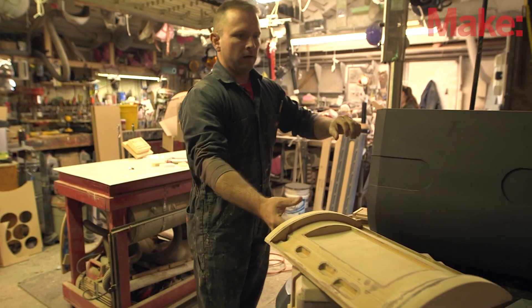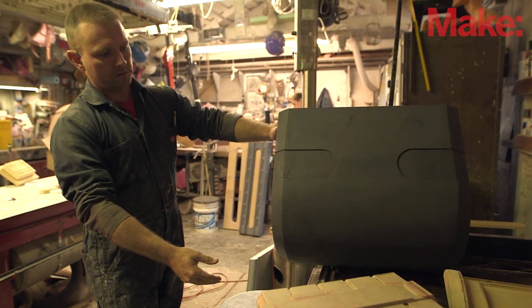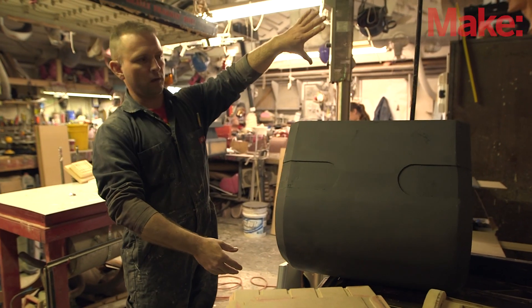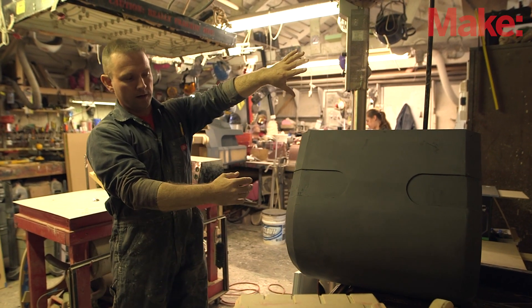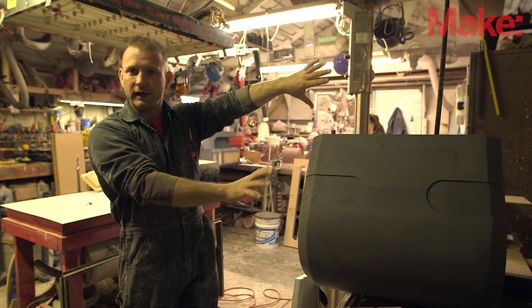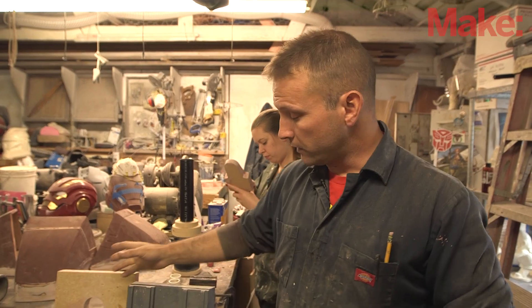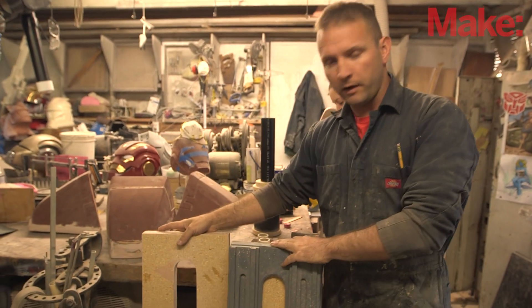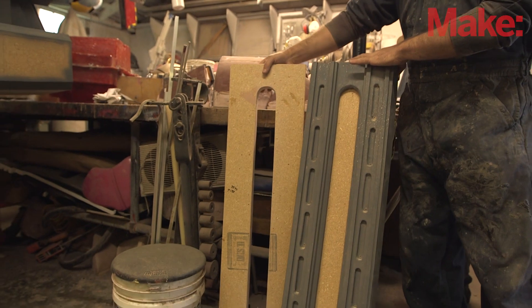We've got the beginning of the pelvis section for the robot here. This still needs to have the rubber-looking waist portion with the corrugated part up here, as well as a corrugated accordion-shaped piece that will come off either side and attach to the leg, so that's still in the fairly early stages of shaping up. Moving on to the next table, we've got forming bucks for the rails that are going to go on the back of the leg. These are going to be back formed as well.